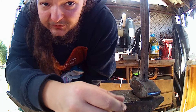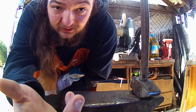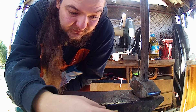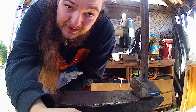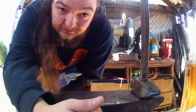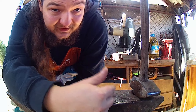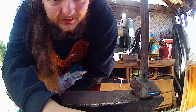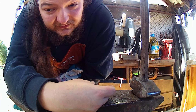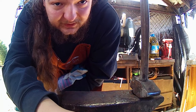What we're going to do, we're going to make a round punch. So we're going to draw out a square taper. I want this to be probably like five-sixteenths, a little over a quarter inch sized round punch. So we're going to draw that out into a square taper, we're going to knock down the corners, we're going to take our time, round it up real nice, get it nice and smooth, make sure the entire bar is straightened, then we're going to take it to the hot cut and cut that off the parent bar. Then I'm going to taper back the end a little bit to give a nicer striking surface, make sure everything's nice, straight and true, shut off the forge, and then we'll take it to the grinder, clean everything up, and then we'll move on to heat treat.